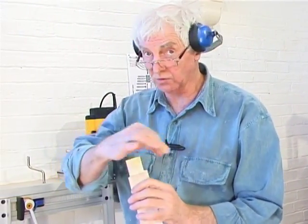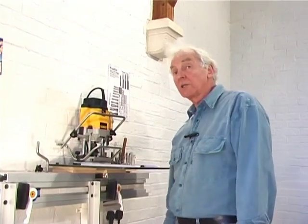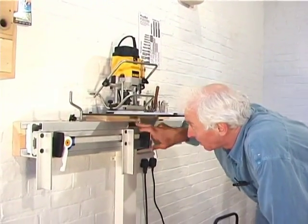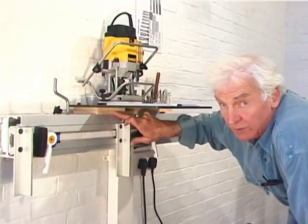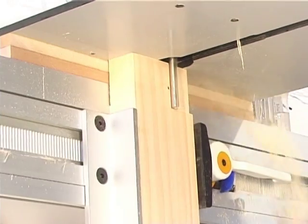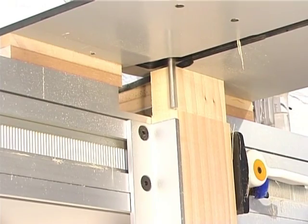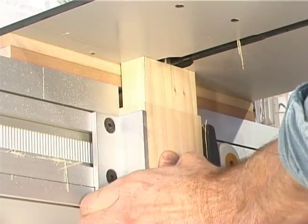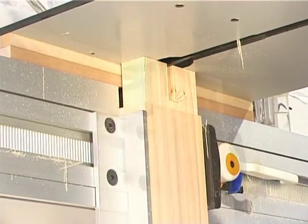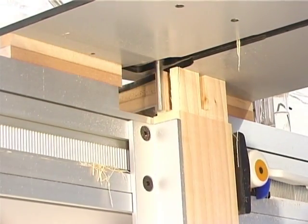But here with the Woodrat we have 4 cuts, straight, square and all of them perfect. The Woodrat is a tenoner. Ordinarily we have a 1-inch depth of cut, but see that I've put in 2 raising plates which will give an extra inch, and that means a 2-inch depth of cut, which is fine for most cabinet making work. Woodrat tenons are quite straightforward. You can make the whole gang. Stub tenons, double tenons, twin tenons and double twin, as well as simple laps and rebates.